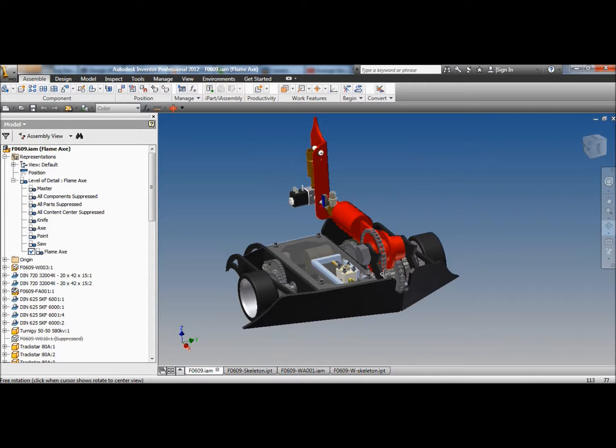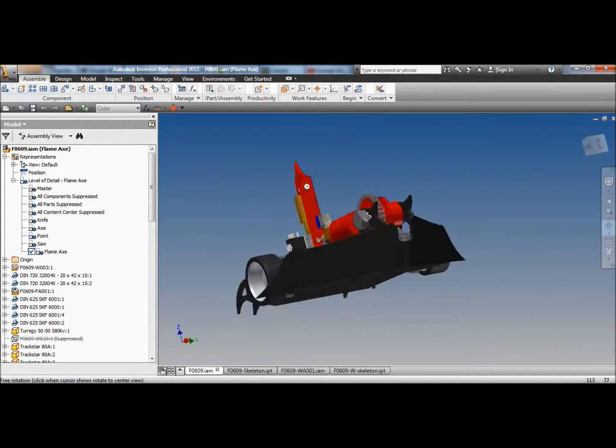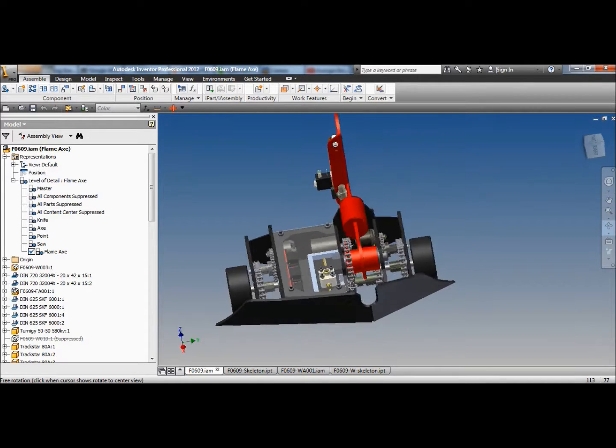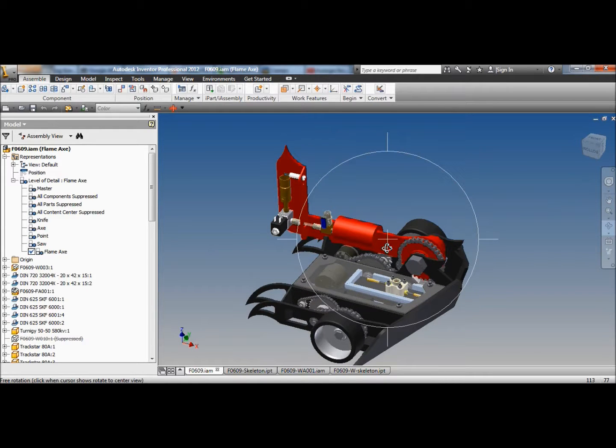So I don't really want to mount the switch in. I want to make this so it plugs on very quickly. I don't want to have to pull the whole robot apart and fiddle with all the electronics every time I unplug, take the axe off. So I really need all the plugs down the bottom here. So yeah, the relay, the solenoid switch, the relay switch, should be mounted to the axe. So I'll have to get some dimensions for it and see what I can buy. Put in a couple of holes here so I can cable tie it to the handle.